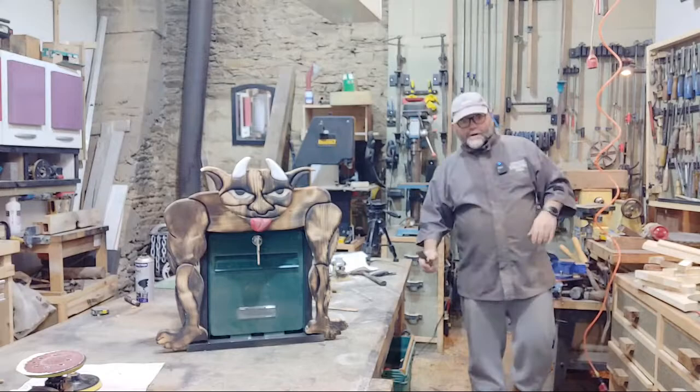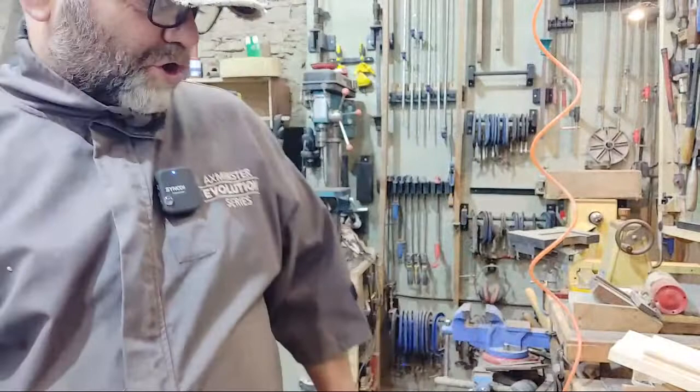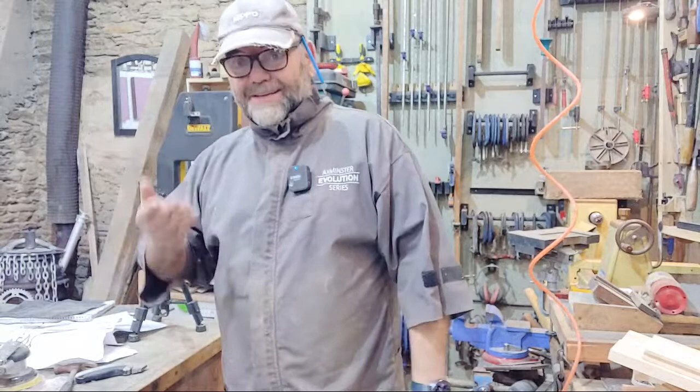I've got a little technique I do when I'm sharpening my chisels. I've got a few ways I do it, actually. One is I'll use a linisher if I want to do my grinding. I don't use a grinder on my chisels. I use a linisher, which is like a big belt sander. Because it's flat, I get a better job. Whereas with anything with a round wheel, you've got to create a concave in your grind. I don't like that. That's not what I want.